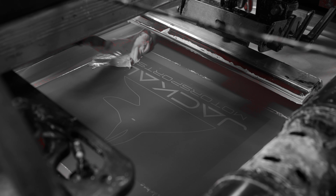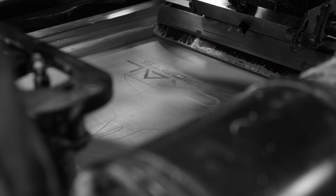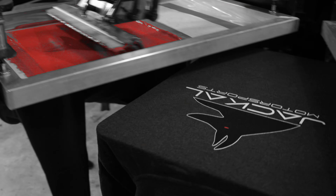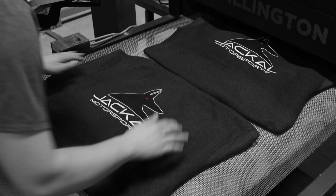We start with adding some white ink to the base, add the black ink, red and white. A little spray adhesive and get those hoodies on the platens. Stroke the white — two passes of white — and a flash cure. Then the black, one pass of black, over to one pass of red, and then a final hit of a top white to really make that white nice and opaque. Same with the front hit — white, black, red, top white. Sharp.